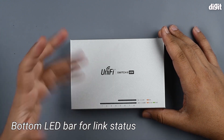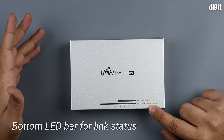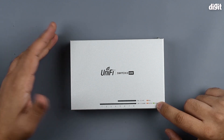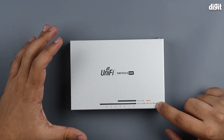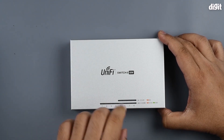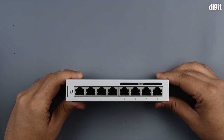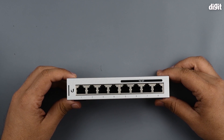If you don't need PoE, the top bar simply won't light up. The bottom bar is about link status — if you are connected to a 100 megabits per second or a gigabit ethernet line, it will light up either in amber or green depending on what is connected.